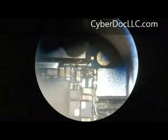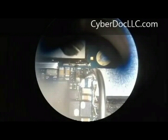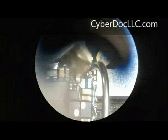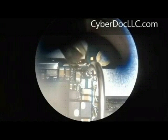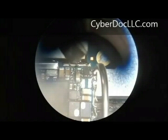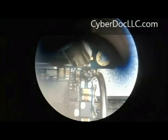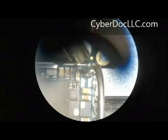Once you put it on, it's still not soldered yet. I'm using low speed, high heat hot air gun setting. You don't want high speed because it might cause other components to fly right off the board. High heat because I really want to heat this up quickly without wasting time heating other stuff. Since this alloy only melts at 60 degrees Celsius, it's pretty much already melted.